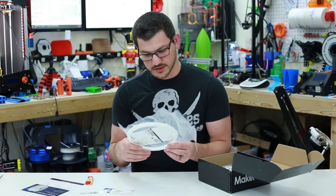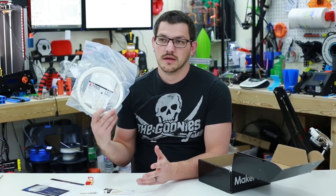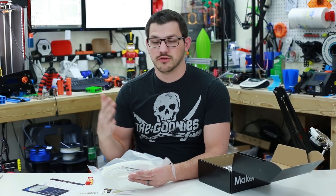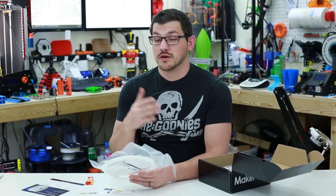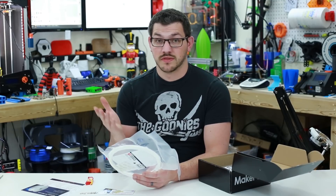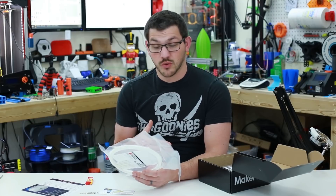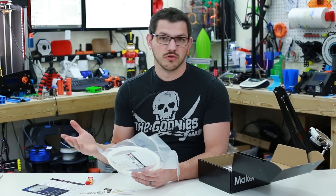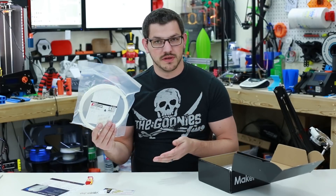With this one you're going to need an all-metal hot end — your throat cannot be PTFE-lined with this filament. PTFE tubing breaks down at around 250°C, and the higher you go, the faster it breaks down and starts to melt. Some say it starts breaking down at 235°C. Do your own research, but do not print this with a PTFE-lined hot end. If you're printing at 270°C, it will melt, you will get a clog, you will ruin the throat, and you'll need to replace it.